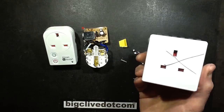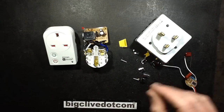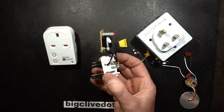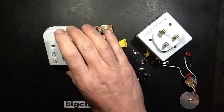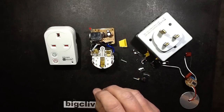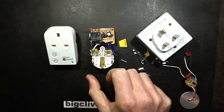This time switch is kind of dead. What actually happens with this time switch is that when it turns on, instead of the relay coming in, it just makes a loud buzzing noise. And likewise, this remote control switch — when it failed, its failure mode was that when you pressed the button, it turned on, then after a very short time delay, it would turn back off again.